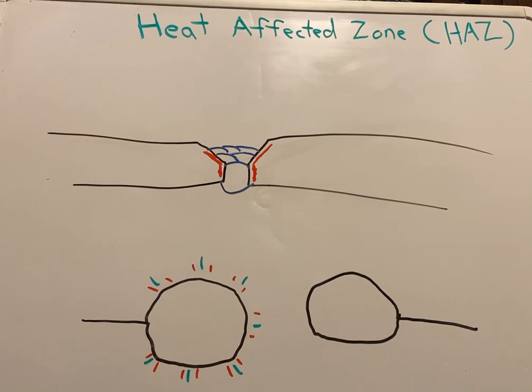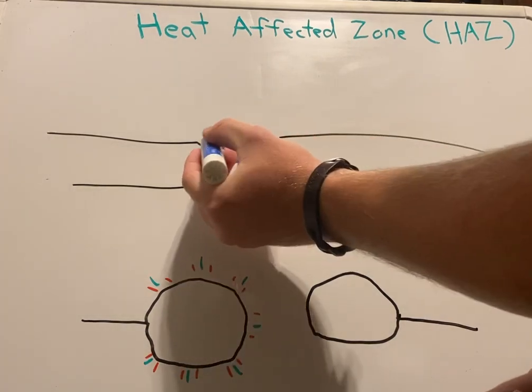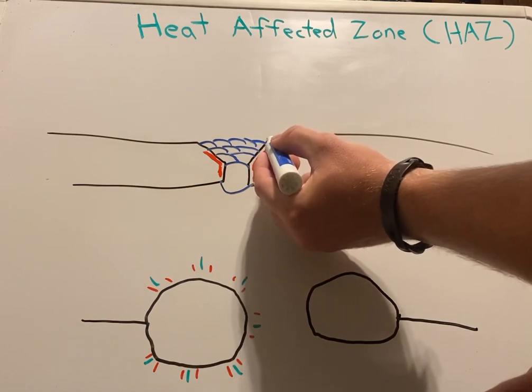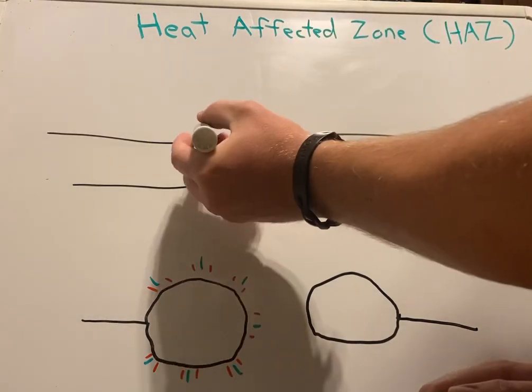It's very interesting to see the welds. Even on modern armor, sometimes they're not the best welds, which is unfortunate. So not only do you have these heat affected zones, but there will be welds that don't even give full coverage. They will leave these pieces exposed, which is a good indication. Let me use a different color to draw arrows.